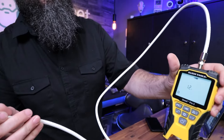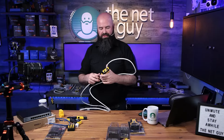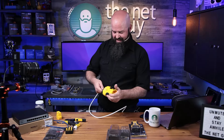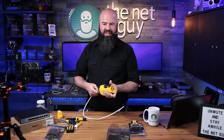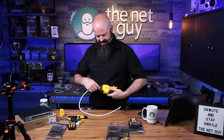What I want to go into is the distance measuring mode. There it is — 12 feet. It just took a while to get that because this thing knows that this coax is well about 12 feet long. If I stretch it all the way out, it's roughly 12 feet. How can it figure this out? It uses a radio frequency that it sends down the cable, and the time delay for it to come back on the reflection — it's just really amazing technology.